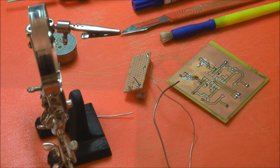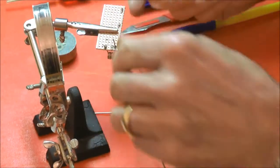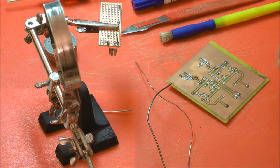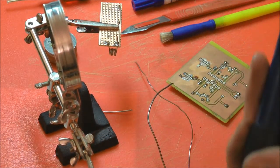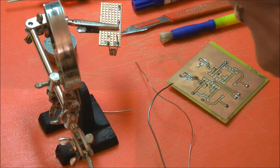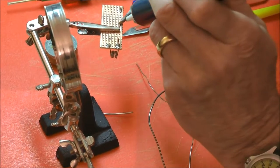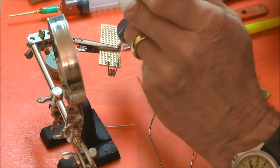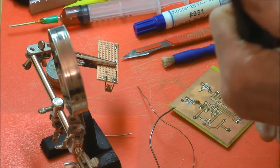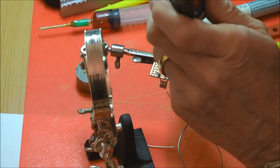Well, it won't take all the solder out of the joint, just the surplus. It can take it all out if you get a good one, nearly all. It will, like for this joint here, if I can heat that. This one, as I say, it's a bit warm, you can stick it over the component wire and let it go. And if you get it right, it will clear the joint of solder. It's very satisfying when you do that, isn't it? And you look and it's all gone. Especially if the component comes straight out. It's great.